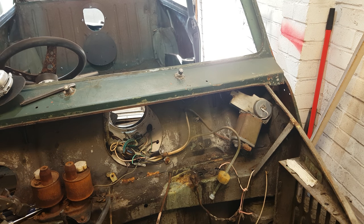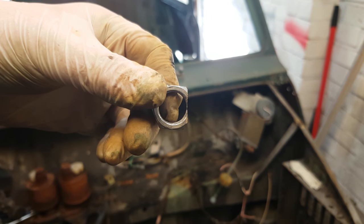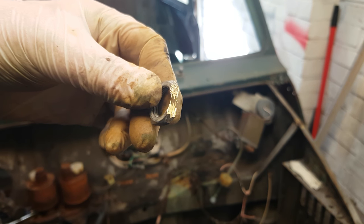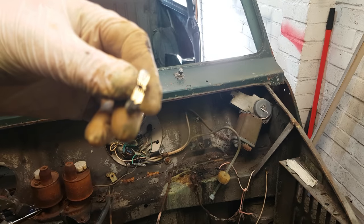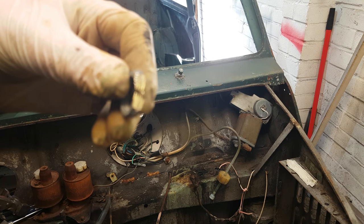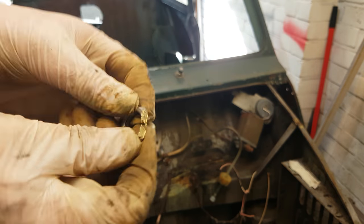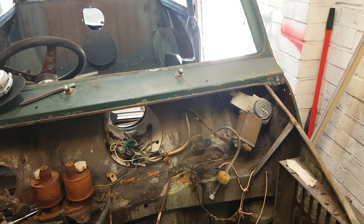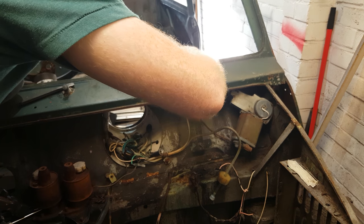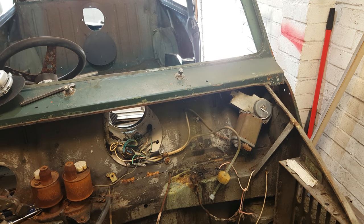That took a bit of time. You can see where I've just ground the nut — you try not to but you skim the threads just a little bit, and that releases the tension on the nut and allows you to tap it round or undo it. So that's another way of getting a nut off — you sacrifice a nut but hopefully save the other bit. Once the threads are on there they're all good.